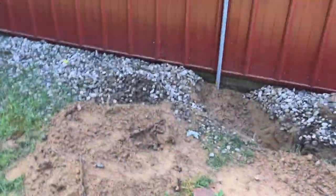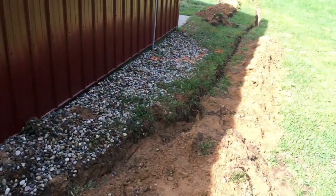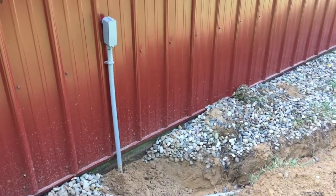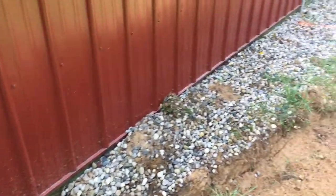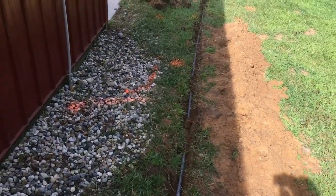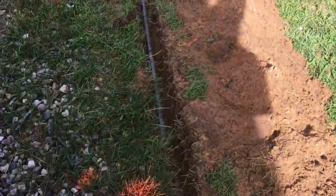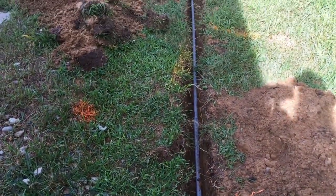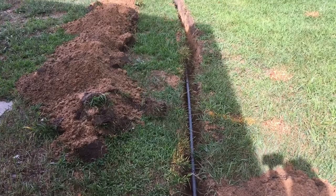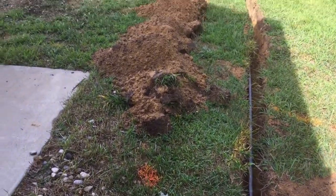This is not really a how-to video — it's nothing more than just digging a trench and connecting the dots with about a 200-foot direct-burial Cat6 cable. Then I thought, 'If you're going to dig a trench, spend a little more money,' so I put that inside a three-quarter inch plastic conduit and glued it all together, because there's a good chance the internet will change someday.